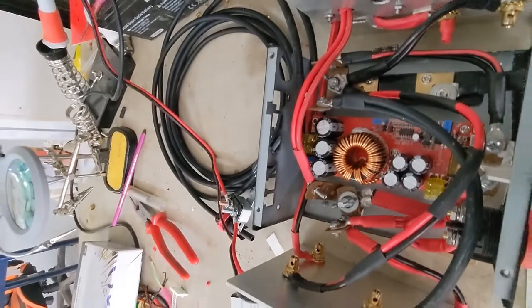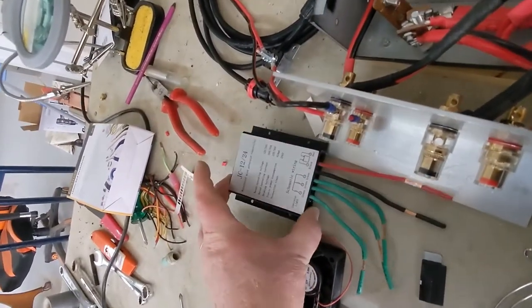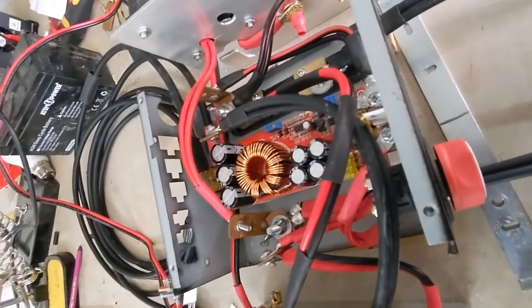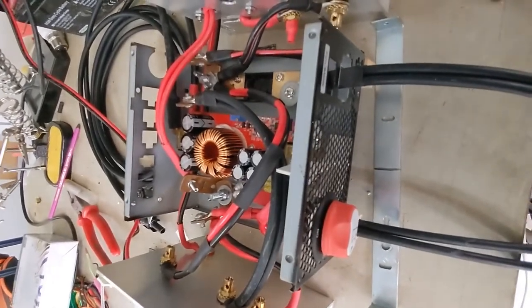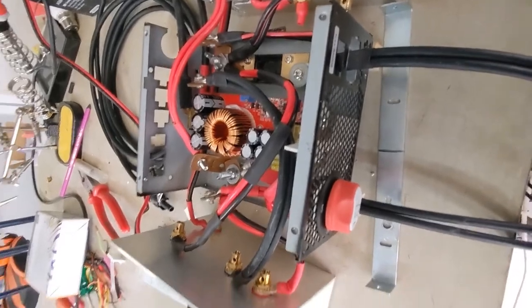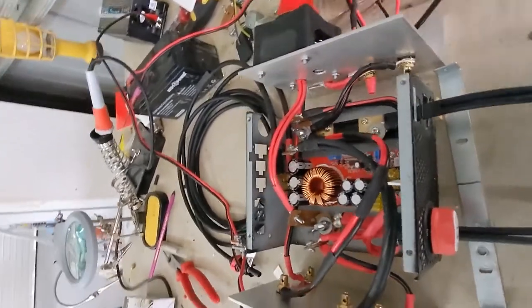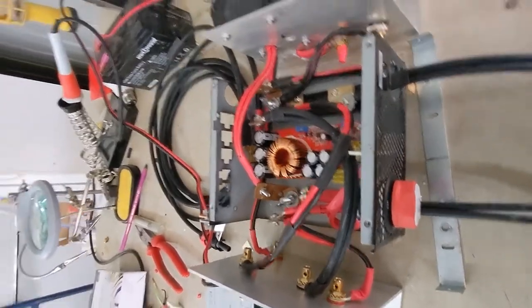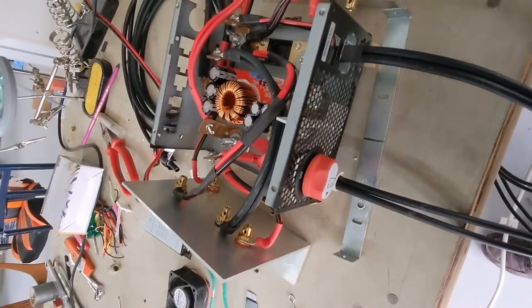Why would you want to do that? Various reasons. One is that there's no way you're going to get a small wind charger like that to be able to charge a BYD high voltage battery — there's not enough EMF to push it through, so it would never ever charge it. So what we want is an intermediary, and ideally the inverter that's already on your grid tie can accept a wide range of voltages from the PV line. It's got very clever smarts and an MPPT controller to track those voltages. In our case, we're actually going to give it a constant voltage, and there are settings you can change in those grid tie inverters to get better optimization.